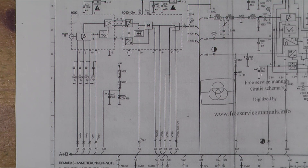As the fault is affecting both the RF and the composite, and since this is the first thing that the input is connected to, I think this will be a good place to start looking. I'll have a look at what the signal looks like going in and coming out, and I'll also check the supplies to the module.